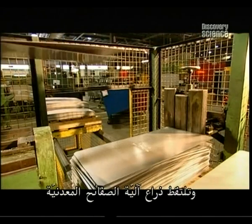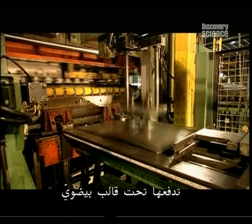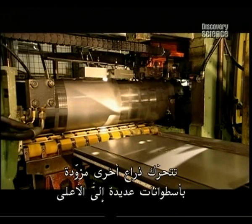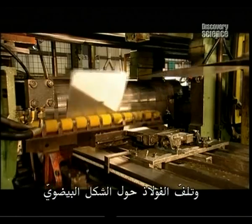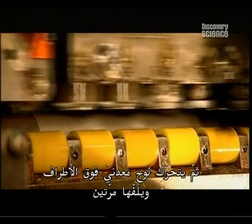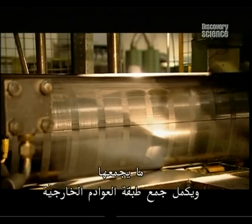Next, a robotic arm picks up metal sheets which will become the outer skin of the exhaust box and pushes them under an oval mould. Another arm with numerous rollers moves up and wraps the steel around the oval form. Then a metal block moves over the ends, double folding them. This locks them together and completes the assembly of the exhaust's outer skin.